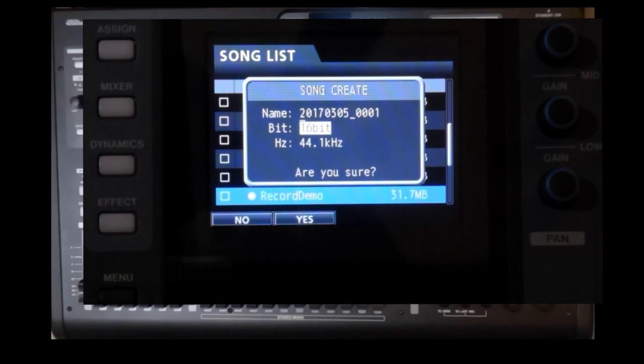Your audio is continuously varying. If you take one snapshot every second, you'll just get a series of clicks when you play it back. So how about 10 a second, or 100, or 1,000? Whatever you pick, there will always be a gap between snapshots where you won't know if the voltage level has changed. So just as with the accuracy issue, the more snapshots you take every second, the better the quality. But the more data you have to process and store.